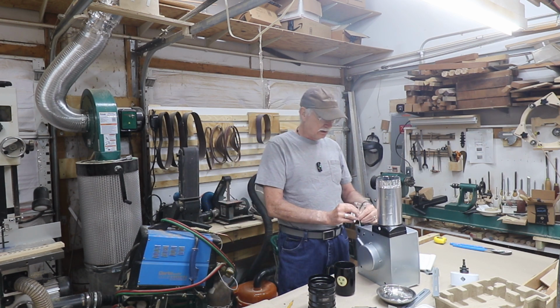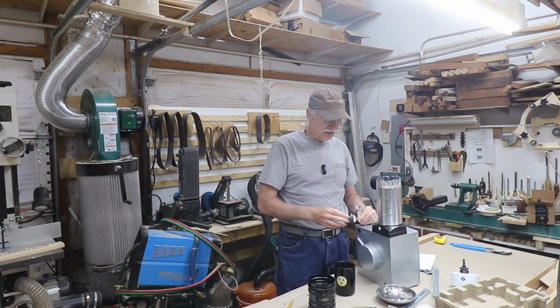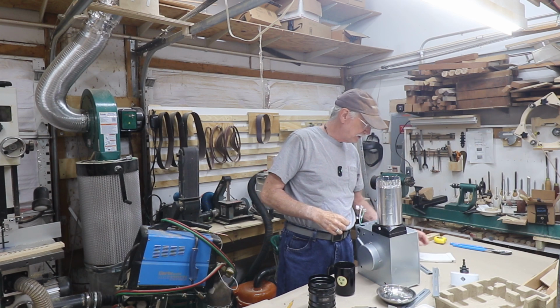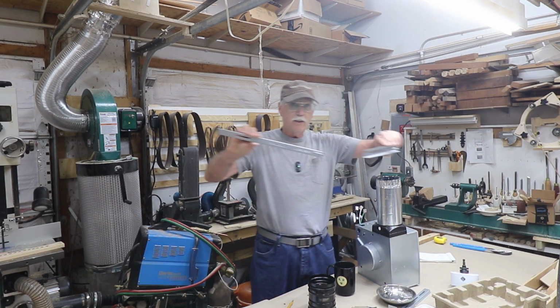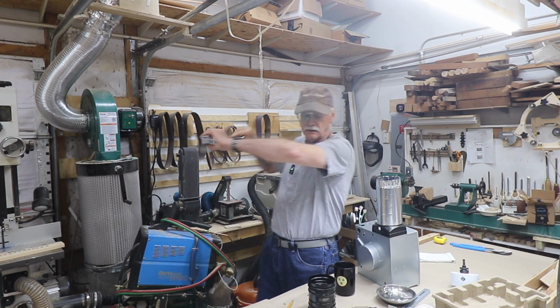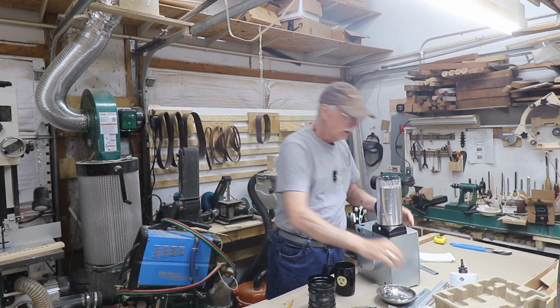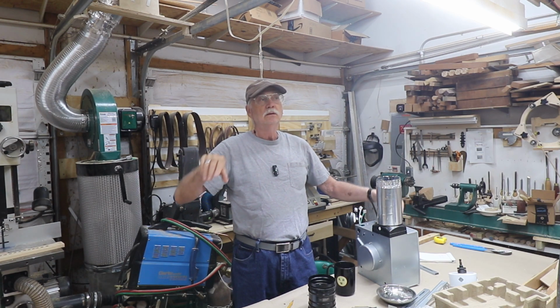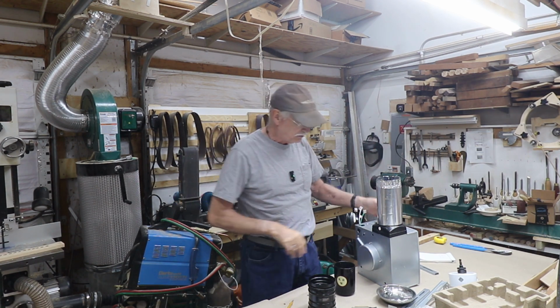And I've already got the Wago connectors in place. I don't use wire nuts in anything anymore. I use Wago connectors. I like them very, very much. These brackets also give me a chance to slide it, facing the wall, back and forth to line it up correctly before I fasten everything down and then test it and then close up the ceiling.